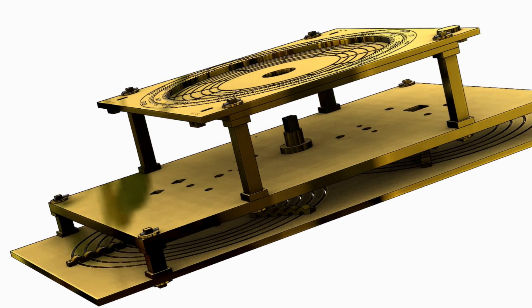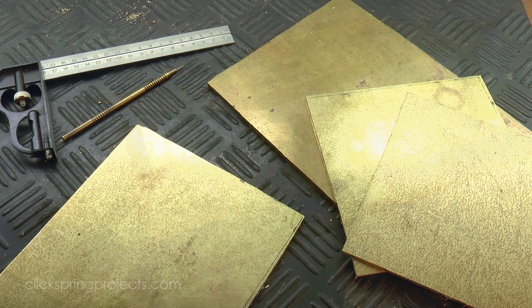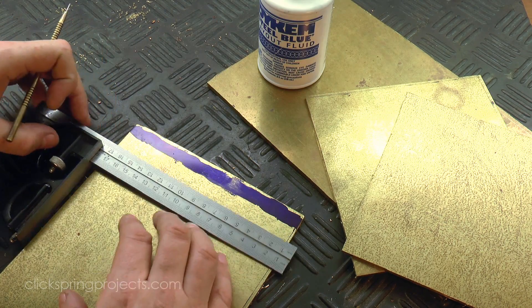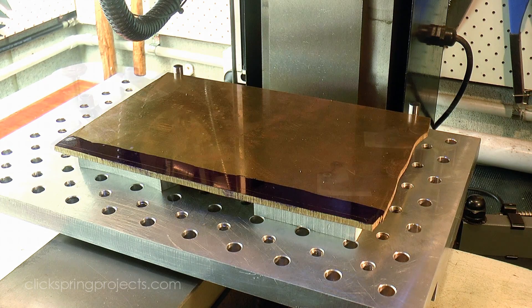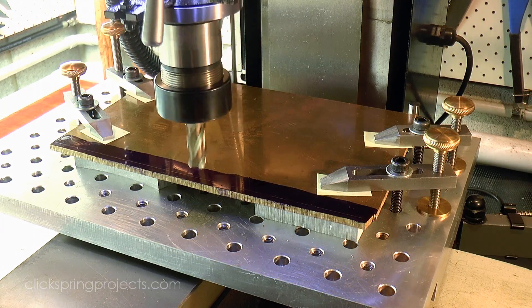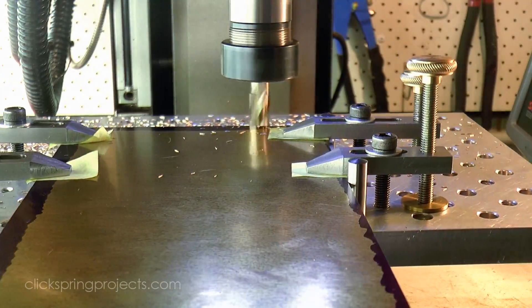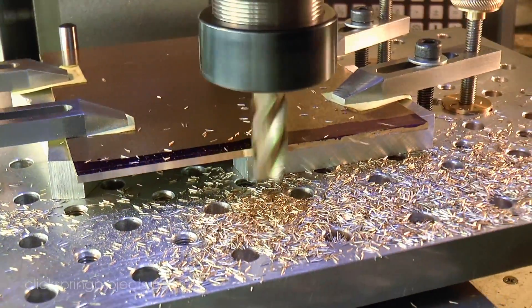And you can see that it has features spread across all three levels that are all somewhat related. Now some of these features will be depth from the main central bearing, some from features on the rear dial, and some will be located relative to specific components once their position within the mechanism has been determined. Many of the features need to be formed with two or three of the plates stacked together for reference, like for example the main bearing position.